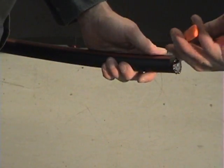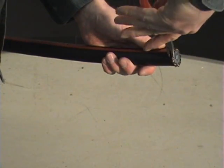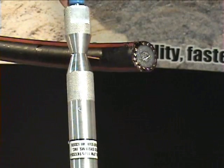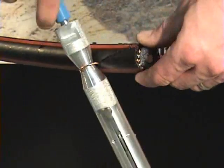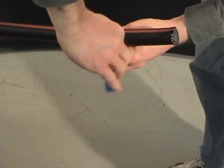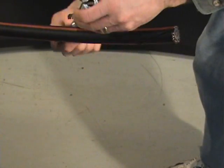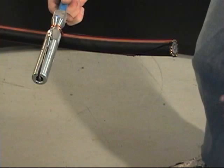Use your pliers to pull the neutral wire back approximately one and one half inch. Insert the neutral into the center hole in the neutral winder. Ratchet the tool down and around the cable until the tool reaches the square cut. This method protects the neutral wire and prevents breakage by maintaining an even pressure on the neutral as it is pulled through the outer jacket.